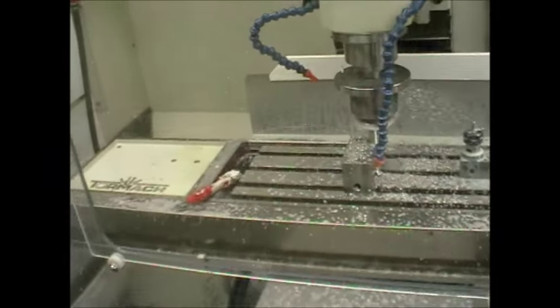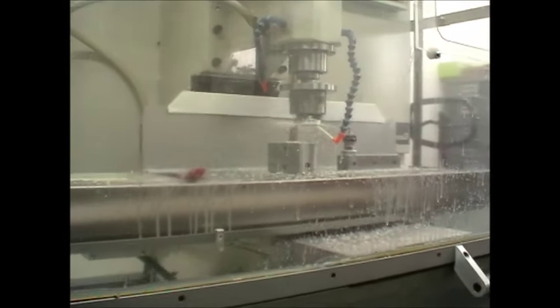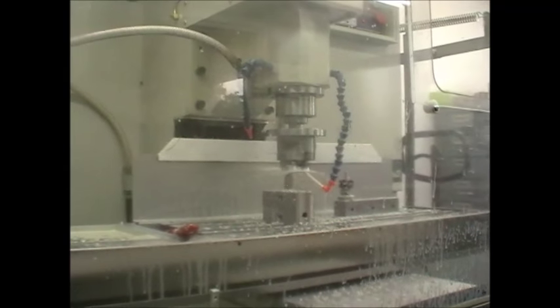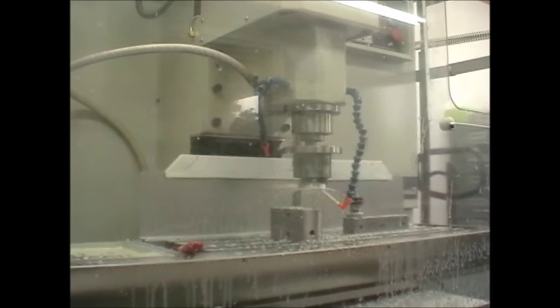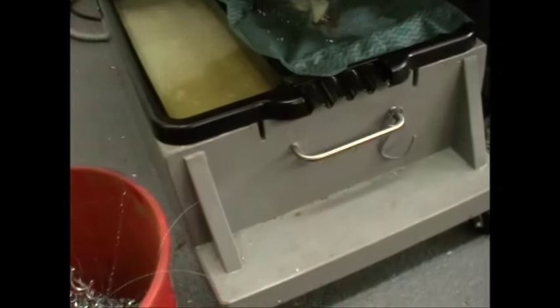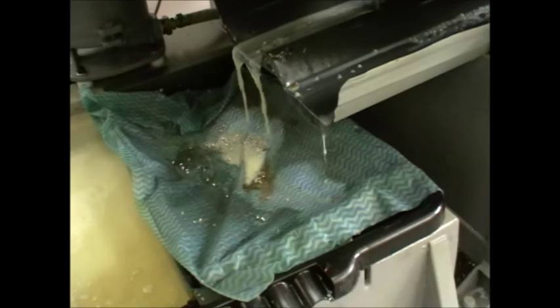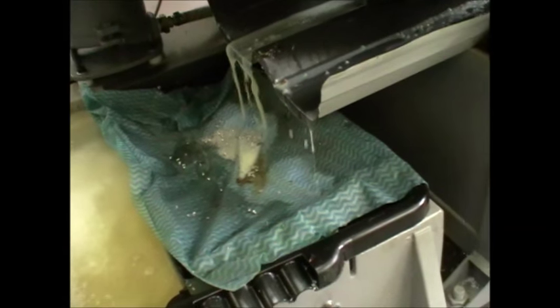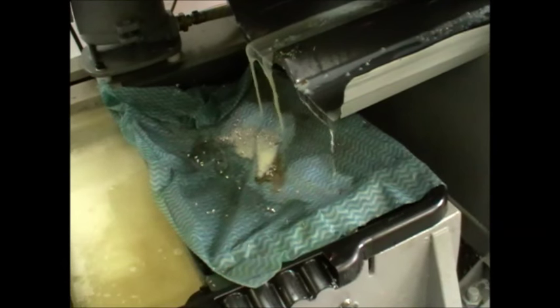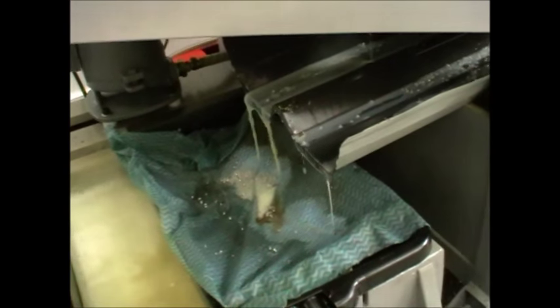Just a few other things I've learned in recent weeks. If you're running plastic, wood, and so on, you get little particles floating in the coolant. They can get into the coolant lines, inside the nozzle, and block up your whole system. I found a way of getting around that — this is my coolant tank. Just put a rag, like one of these rolls of synthetic rags, and let the coolant drain through that. It separates out the little particles of wood and plastic so they don't get into the coolant system, and slowly you filter and clean out your system.